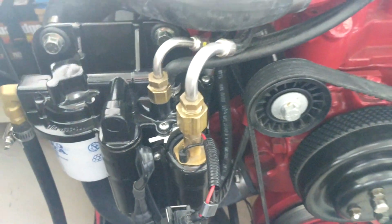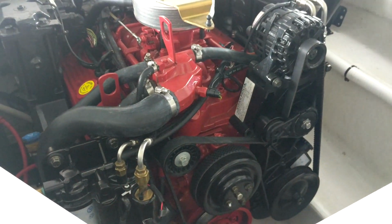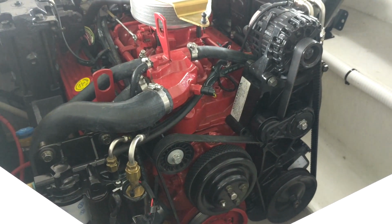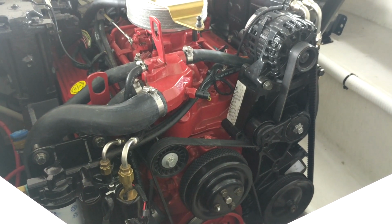down in the water. We're fortunate enough to be on a hoist right now, so we're just gonna lower it right down in the lake. If you're at home in your driveway or in your garage, put some earmuffs on it, run water to it. Through the out drive.